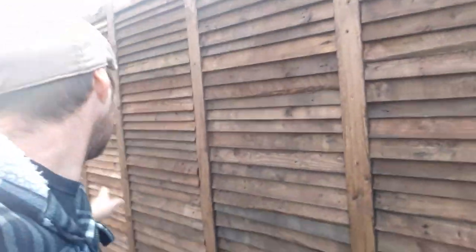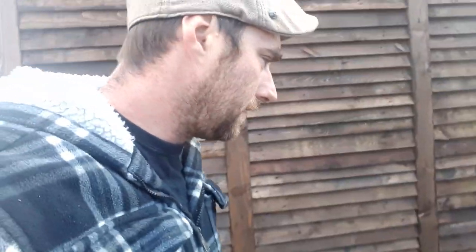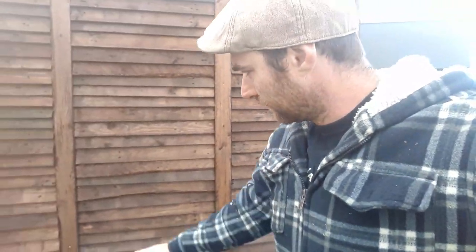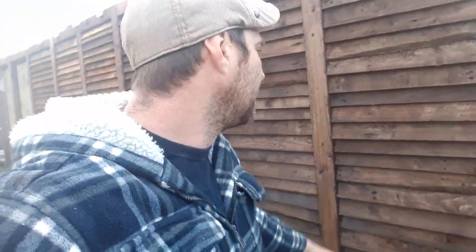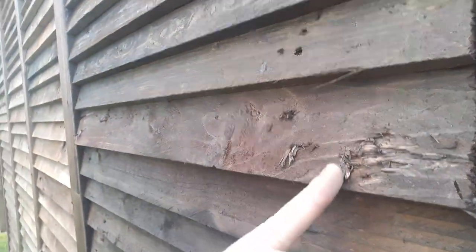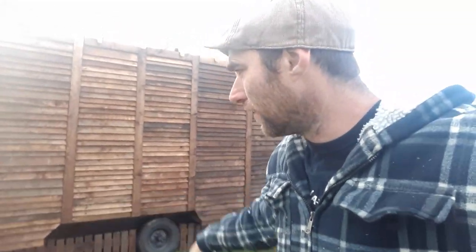It's not quite finished - I've still got to work my way around and there's lots of details to go on. All of this has been dipped in Bird Brand Eco Soap - every piece has been dipped into that before it's been screwed up. I haven't bothered sanding anything, because I'm going to blowtorch the whole thing. Obviously I'll have a water sprayer with me as I do it. As I blowtorch it, it will take off any of this furring - that will just burn off. It'll darken the wood a bit more and bring out the green. Once it's been burnt and cleaned off, a friend of mine's got a sprayer and it'll get sprayed with another coat of Eco Soap. So it'll be a really dark, dark black-brown, and it's finished.